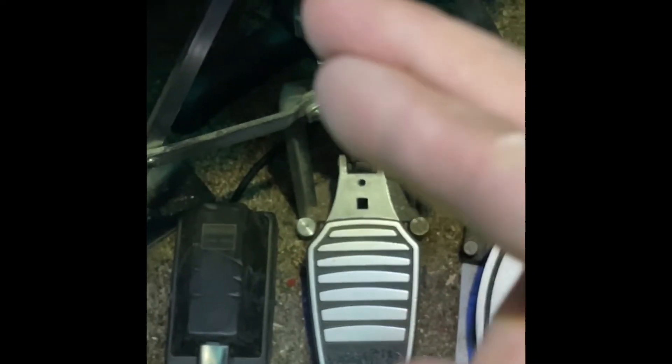What I did is I had to take the thing apart, and I ended up flipping the switch so that when I push on it, it actually opens. So I made the switch normally closed, and then when I push on the pedal, it opens, and that's when it sounds. Because the way it was, when I pushed on it, it wouldn't sound — it would come together, and then when I let go, it would open. So basically it was sounding on the upbeat.